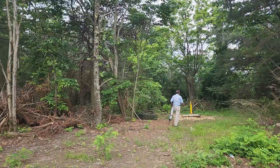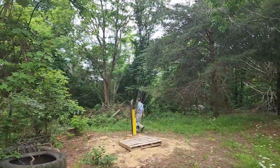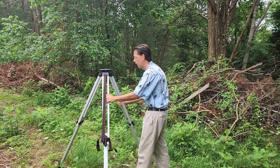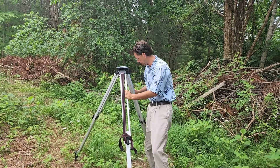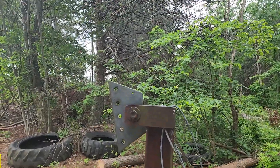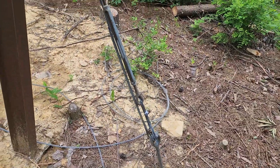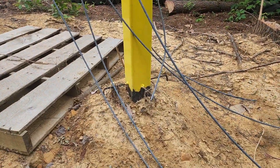As best as we could tell by looking at the old posts and when we were digging just in front of them, we didn't hit any concrete for the old posts, so we don't know how many bags of concrete were used — but it wasn't very much. They were also using an anchor cable on the backside just to try to keep it from moving forward. Ken is setting up the other tripod, then we'll get out his trusted David White transits, get those level, and start utilizing the transits to go up one of the legs of the tower to see if the tower is plumb.